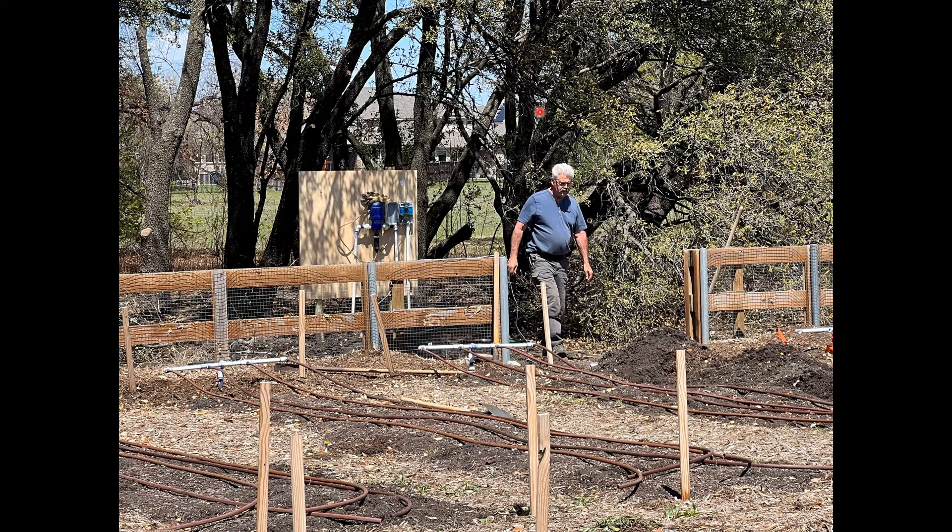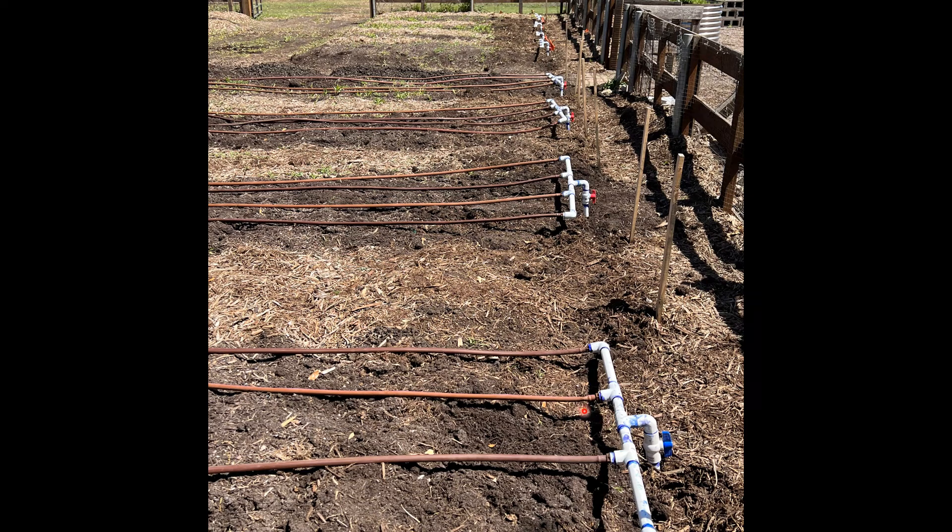This is the panel, and this is Mr. De Bill Hubbard, an expert who volunteered his time and expertise to do the smart work — I did the physical work. He installed all this. You see here this is the 4x4 panel, this is the fertilizer injector — water will be coming in from the main irrigation line of the farm. If I need to fertilize, I drop the hose in the fertilizer barrel. This is the control panel that will control the solenoid valves. Showing you one zone finished, except for flushing it with water and then closing the ends. I will finish the last two zones after the glue seals and dries up, and then we can turn on the water and finish the rest.